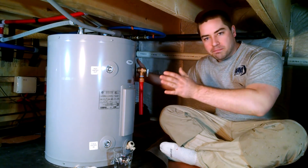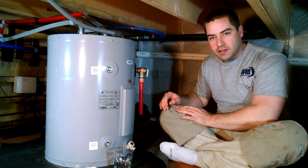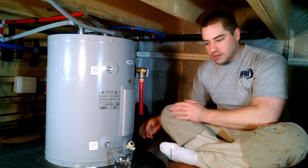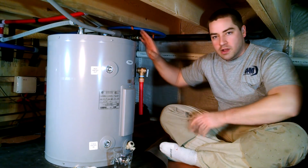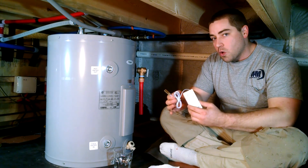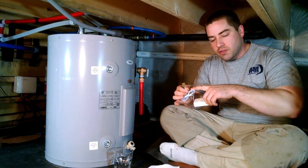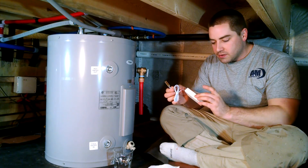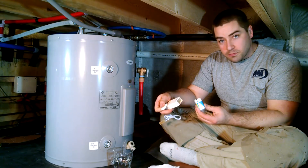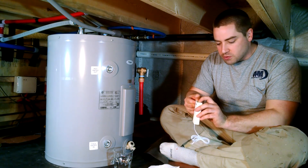When I do that I'm going to build a box around this thing, and I won't be able to look in very easily, so I want to make sure the pressure relief valve is not dripping, that it's not filling with water, or any signs of leakage in advance. So I picked up this siren that goes off if it senses water. I'm going to have the siren outside the insulation and run the wire in with this little sensor. I also picked up lithium batteries so hopefully I don't have to change them as often. I'll leave links to all these items in the description below.